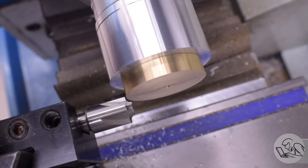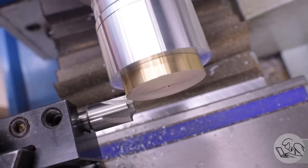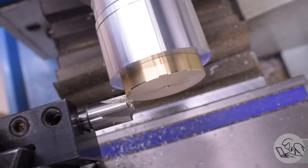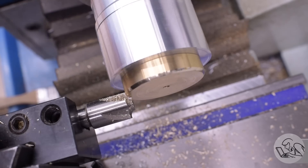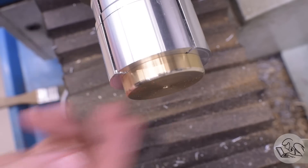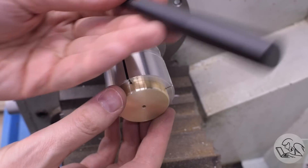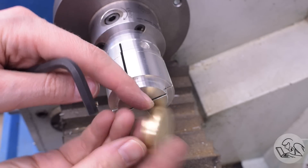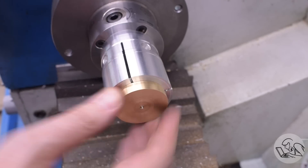Let's give it a little test. I collapse the chuck, put my piece on there, and then expand it again. It takes a little more than a quarter turn to get tight because it was machined with a quarter turn of expansion already on it. I don't want to overdo it because this is a thin-walled part, but just a little bit of pressure and that seems really solid — it's encouraging. I've got a corner rounding tool I'm going to use on this, which is an acid test of this fixture because corner rounding with a form tool involves very high tool pressure. If this part is going to slip or fall off, we're about to find out. Well, that worked like a champ — I had no issues at all, and it gripped extremely solidly without damaging the part, which is exactly what I was hoping for. This fixture repeats too, so I've got four of these to do — bring in the next one.